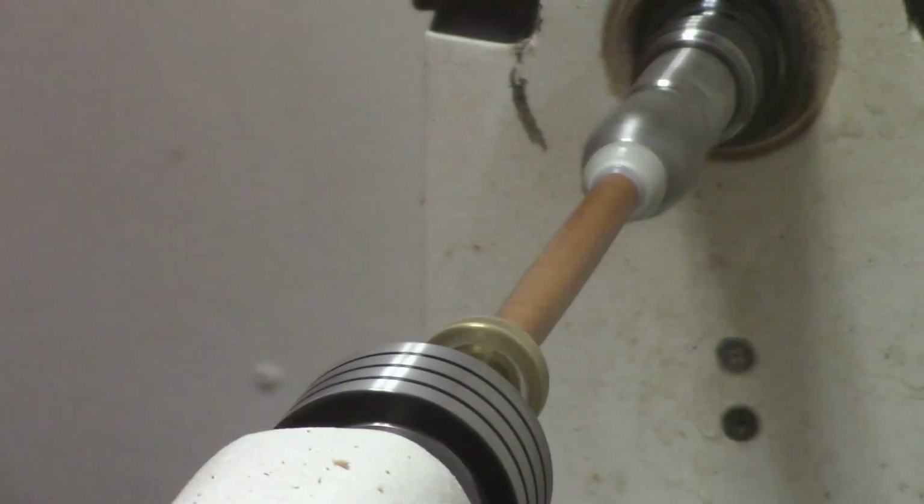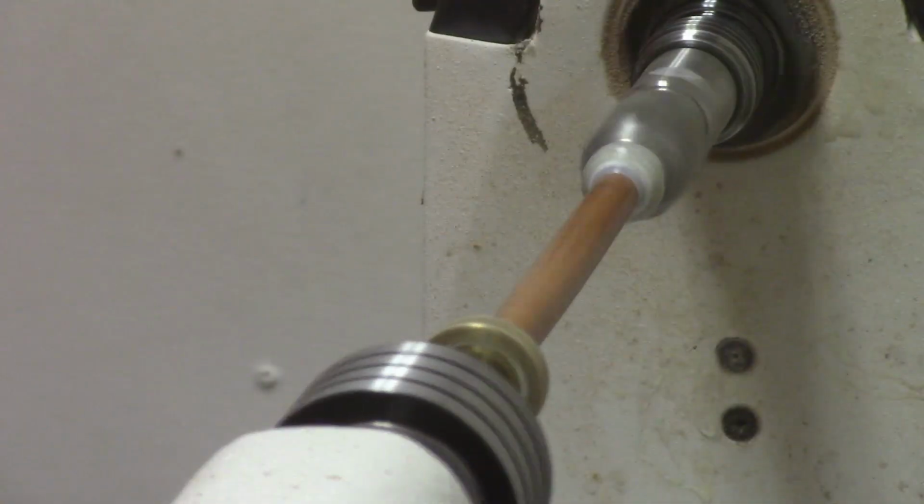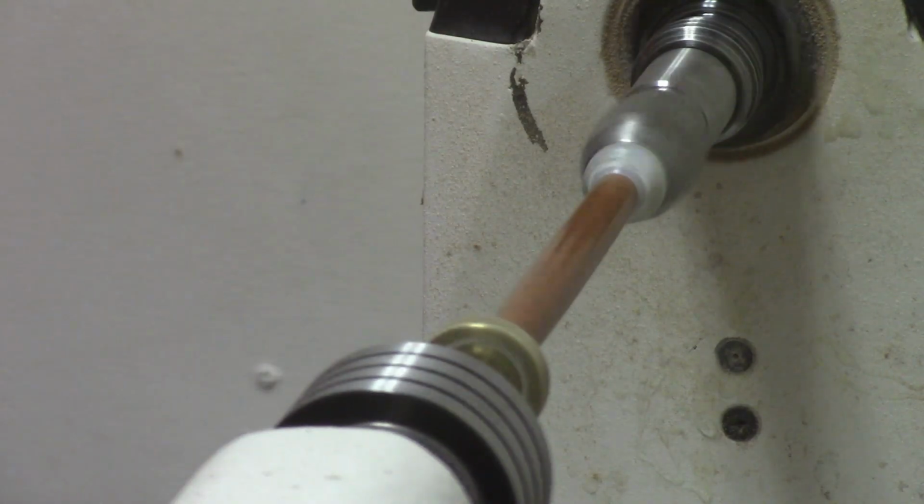After I wiped the denatured alcohol on, I let it spin dry for a little while, and then I apply 7 coats of thin Mercury Flex CA glue. I spray activator in between each coat.